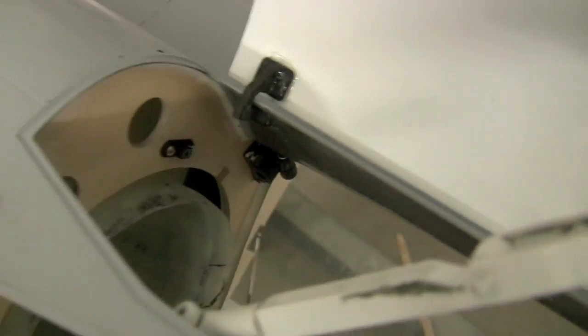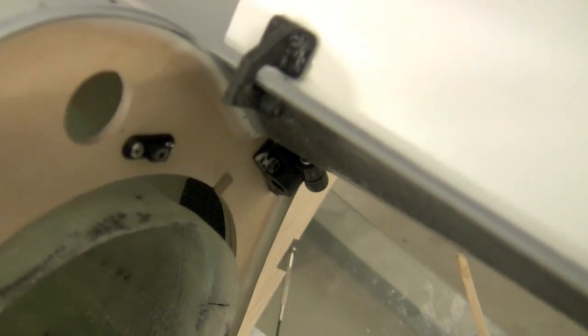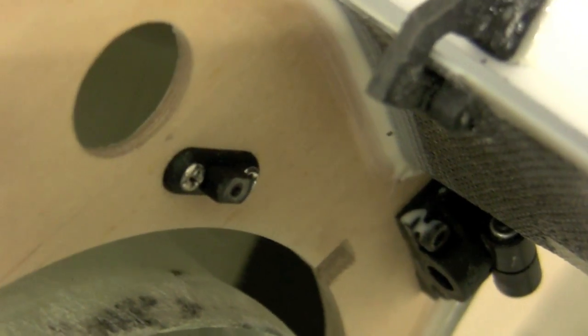I'm going to go ahead and mount this air cylinder over right there. I've got the mount in. One little hint, and it's probably a no-duh thing, and probably even what the instructions say, I just haven't been following real closely: mount the mount first and then mount the air cylinder. When I first did it, I was trying to do it all as one piece, but then the air cylinder gets in the way of getting a screwdriver in there unless you've got a small diameter screwdriver. I was able to mount it with the air cylinder on there, but it's a heck of a lot easier to put the base on first and then put the air cylinder on. So I'm going to go ahead and mount up these air cylinders.